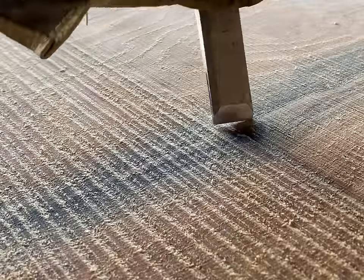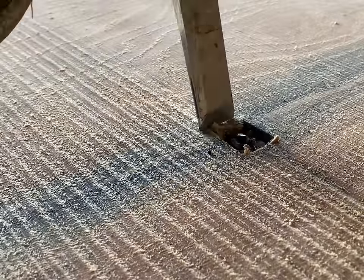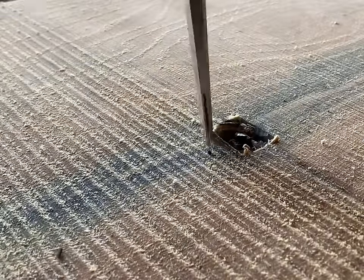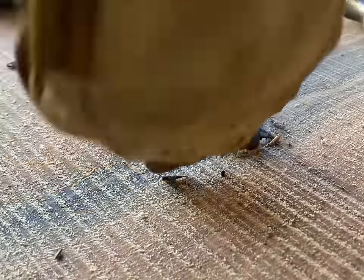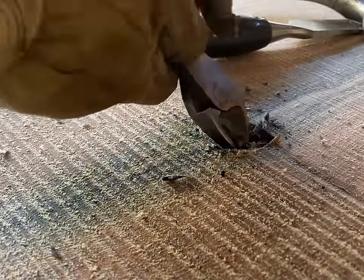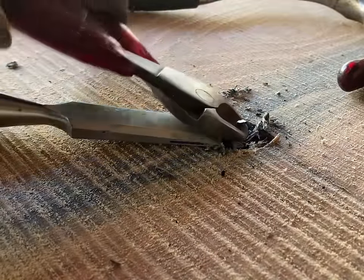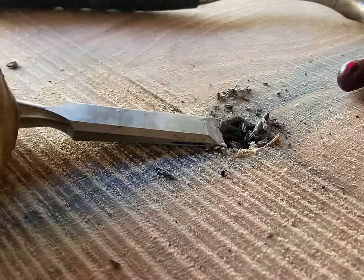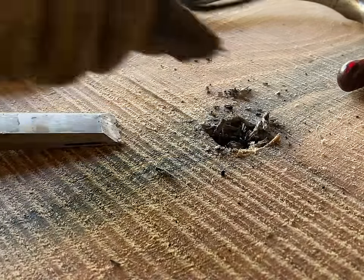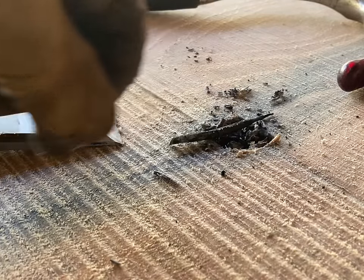I went over this log with a metal detector before I brought it in the building, but we have cut down probably 7 inches from the bark where we've used the best metal detector known — which is a saw blade. This was a brand new blade, so you can see how good it was cutting on the right side of the screen versus the washboard on the left side. That's because a piece of metal messed up the set in the blade and dulled it extremely as well.